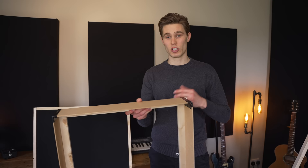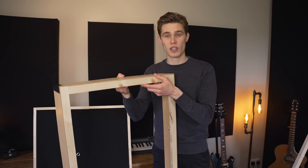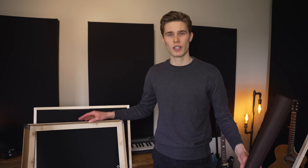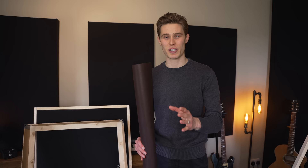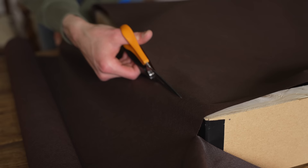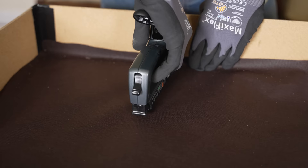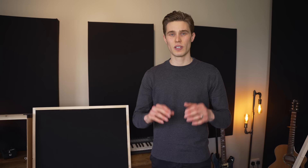The next step is to seal the back of the panel first, which is maybe a little bit counter-intuitive but I'll explain why. The panel has a front — which is the side that's just got the board — and the back is the side that has our strong wooden frame. We're going to fill our panel from the front, so the first thing we have to do is add a fabric backing to the inside of this back frame. The best one is actually just a gardening fabric, which is a soft fabric weed barrier — it's incredibly strong, none of the acoustic insulation is going to pass through it, and it's also incredibly affordable at about five pounds for 10 or 20 metres. After cutting that to size I stapled it in from the front side of the wooden frame to make sure we left an air gap at the back.